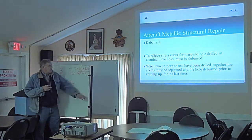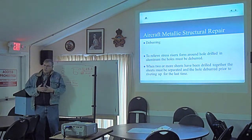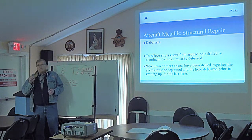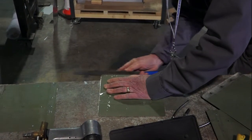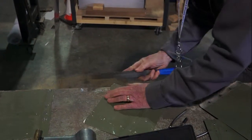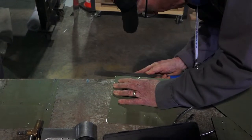So we talked about deburring, and deburring is not just the holes. Every piece of skin that we cut — we take it over to the shear, stomp it, cut it to the correct size — we need to get rid of all the stress risers along the skin. Even a shear, if you magnify that finish, you're going to see all kinds of jagged edges. We'll deburr with a file on each corner, all the way around, and whatever cutouts we have — we need to radius every single corner.